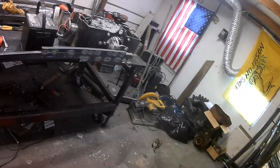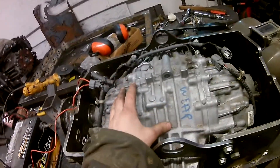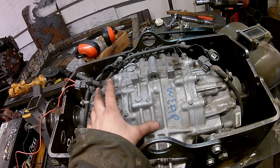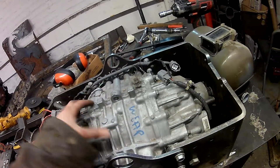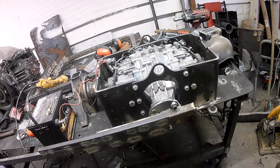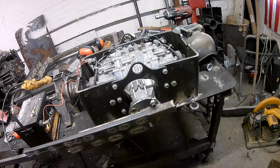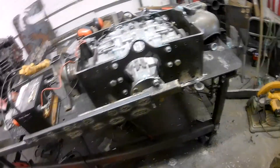Really not as much as I was hoping. It's obviously designed for a crossover vehicle, so it's not meant to take the full brunt of the engine on an Acura. But this unit will definitely clutch more than a basic alternative. Now obviously that other option is crude — Kalashnikov technology compared to this, which is a nice oil bath wet clutch, much more compact. I'll have to do some thinking because I'm not sure I can hook up a large motor to this setup if I ran two Acura MDXs — that would definitely be beyond the capabilities of this unit with a 1.9. Even with two of them, it wouldn't be able to spread the torque thin enough. If I can keep vehicle weight down and run smaller tires, maybe it would hold up, but you'd never put all that horsepower to the ground — this would be your mechanical fuse.